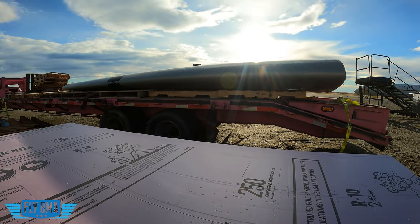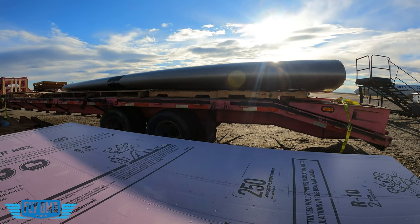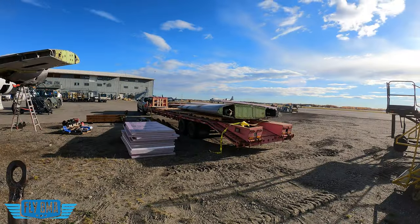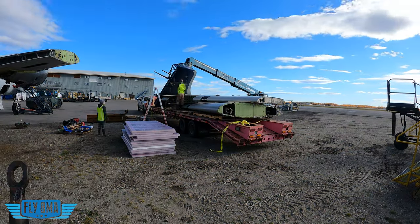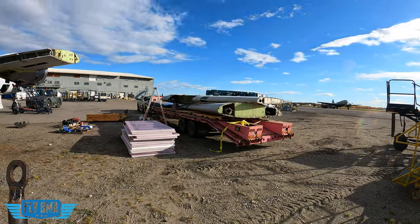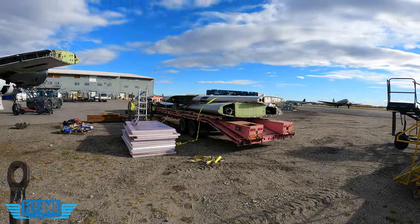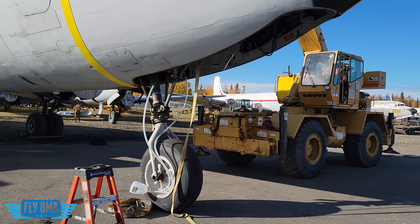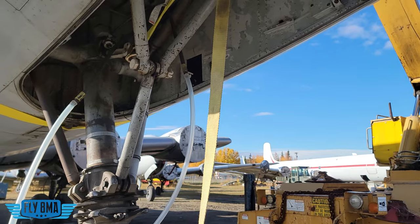Day three was the big day to get the fuselage loaded, all other parts loaded, and the wings cut off. I started at 5 a.m. returning the cinder blocks and lumber to Lowe's to get some money back. Between Steph and Buck from Everett's, they had the brilliant idea: call the trailer over now, use the landing gear still attached — put nitrogen into the struts, extend them to lift the airplane, back the trailer underneath, then bleed the nitrogen out and set the fuselage right down on it. No gigantic crane needed to lift the whole fuselage — a brilliant idea.